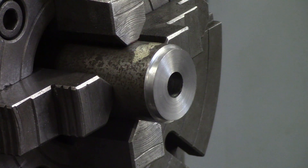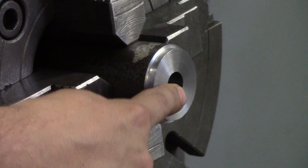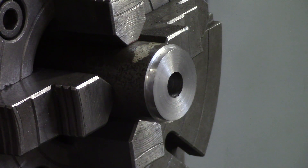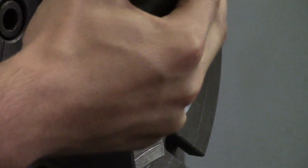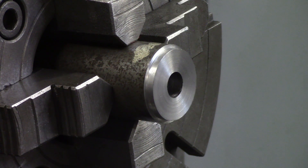For this demonstration I'm going to load up a boring bar, take a few cuts, and then a finish cut to show you what it looks like. To set depth, I use my travel indicator and a stop clamp on the ways. I touch the boring bar off the face, come away from the part, go as deep as I need using the travel indicator, then butt the stop against my carriage and clamp it to the ways. That way, when boring with power feed, it'll hit the stop and the carriage won't go too far. Without a stop, watch your travel indicator carefully and use your hands to feel for chatter — if chattering, slow down or take a lighter cut.